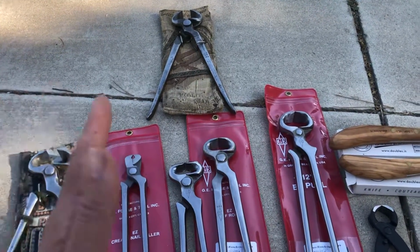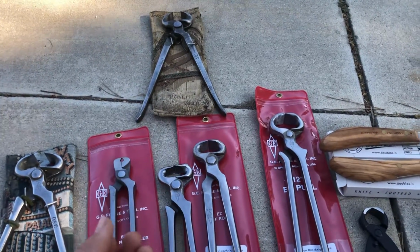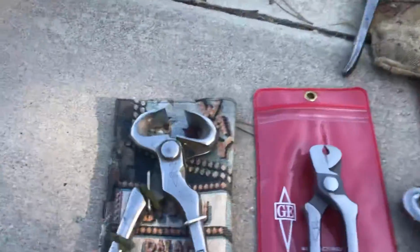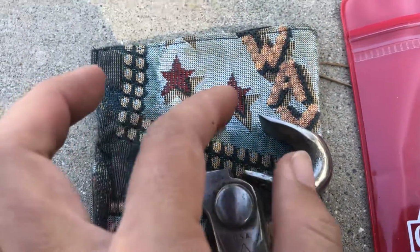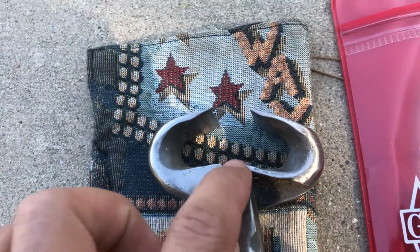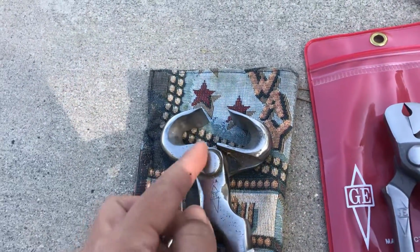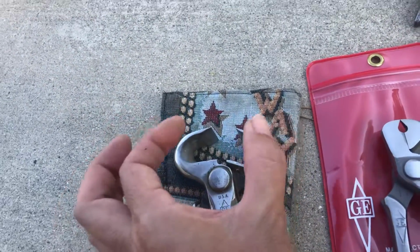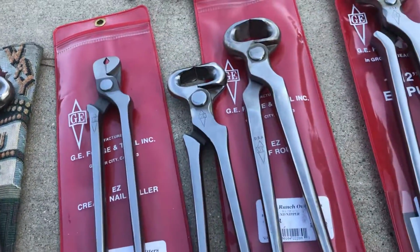You'll have to ask them. It's something like that. So it's only an X number of times that they can be reforged or resharpened. So what happens is, if you just sharpen this, the blade is going to get shorter, and you see the stops here, it's going to make it so that the blades don't even touch. So when they resharpen it, they actually have to cut down on all of the stop too, to make it so that they meet perfectly again. So that's why it's just more involved, okay?